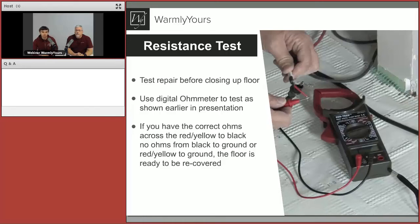When you have the wire taken apart mid-repair, a good idea is to test in both directions — twist the wires at the thermostat end and test toward the thermostat to confirm a complete circuit back that way, then use the shortstop on the wires going the other direction to check the condition further down. If it tests good in both directions from your spot on the floor, you can be pretty confident that when you make your repair you'll have a continuous circuit from the thermostat all the way to the end. The resistance test can be done at multiple different steps of the repair.